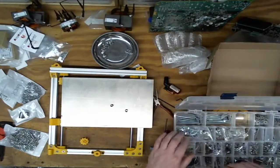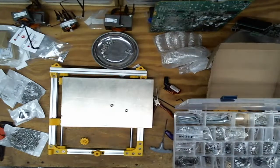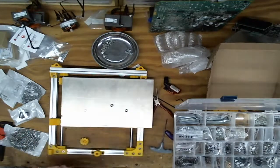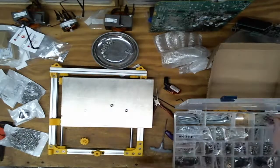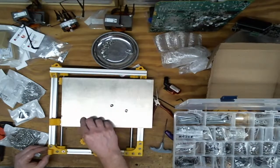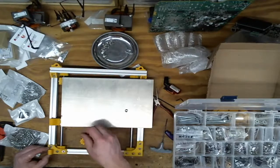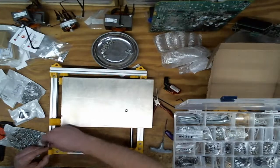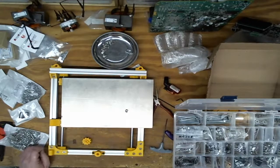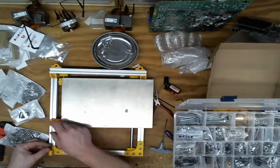So my plan is I'm going to have an M5 washer on either side of this. So you have a nice soft plastic surface against a hard surface against a soft surface. Soft to soft or hard to hard will gall, where hard to soft, the soft side will wear and the hard side won't. Then I have a spring. Whoops. I might need a couple more washers. A spring, 2 lock nuts, then